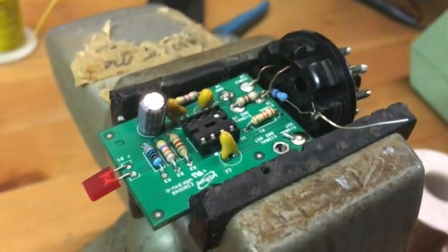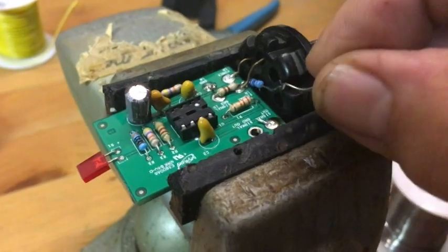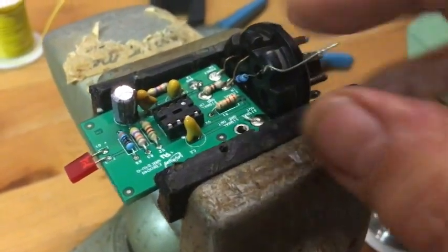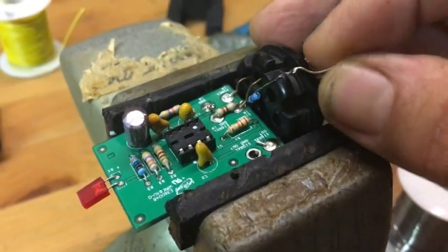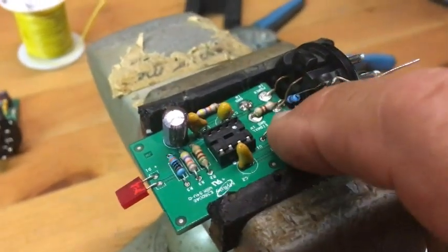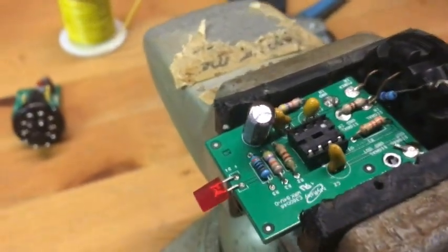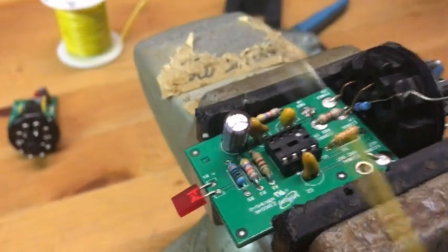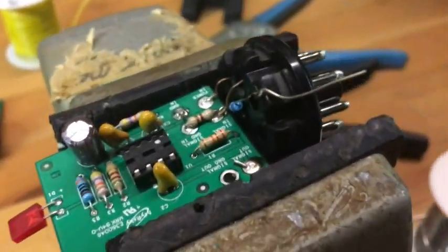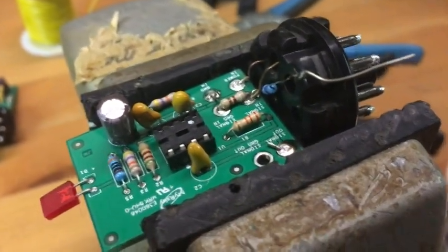Here we are looking at the first of the BAD modules. This wire - I don't like the way this whole thing looks here, and it doesn't look like it's soldered real good down there. I'll put a little more solder there. I'll put another wire, namely this one, into the socket and then bring it out and connect it, rather than try to stick that wire back in there. I'm afraid I'll break this other wire off the resistor.